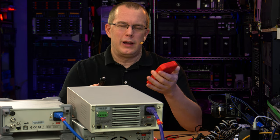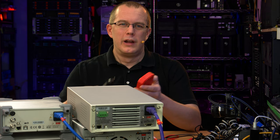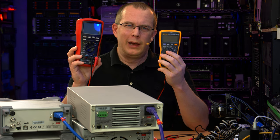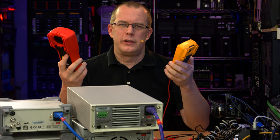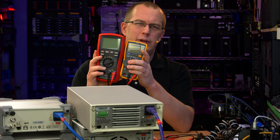As long as it's about 5 volts, I know it's good. If it's dipping down to like 4.5 volts, then I know it's around there. So for approximate measurements, it's just fine, which is going to be good for some of my purposes. Although, to be fair, you'll probably still see me whipping out the Fluke and the Brymen from time to time because they are more accurate and their displays aren't exactly tiny. So good for a lot of purposes on YouTube. And also, size difference depending on how much room I have on the bench.